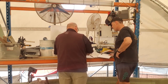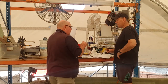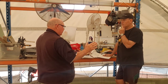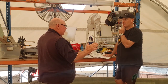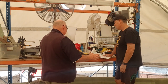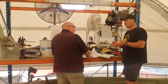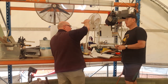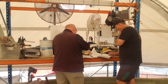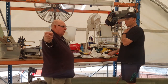So, more pressure. So this one, I'm going to need an accumulator pump. An accumulator tank. What I would do, Ross, number one, build your system without it. Because it's a clip-on. If all of a sudden you don't like it, go buy an accumulator and stick it in. The idea of the accumulator is to stop the lag. Yeah, it stops that drop. It stops the pump hitting full pressure and then dropping too low. That makes sense. And you might need it on that system for the clothes wash. Yeah, the clothes wash. You might not care over here.